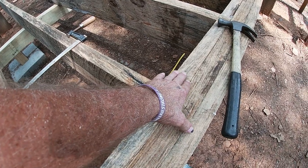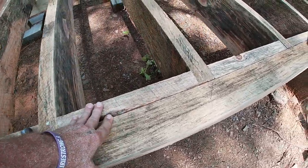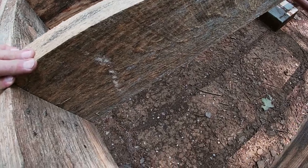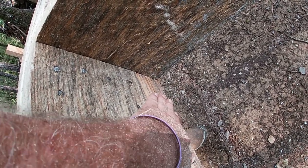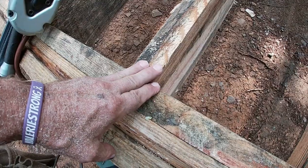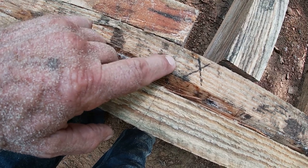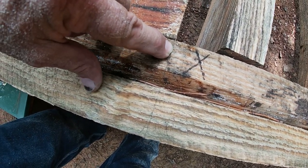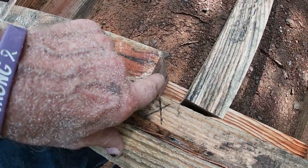I've started anchoring in the floor joists into the beam and I'm also putting a row of blocks in between the joists down through here. I'm using my framing gun to shoot these blocks in and nail everything together, but I am using some three and a half inch torque screws into the ledger. The block itself I'm nailing in with power nails — that speeds up the process a little bit. After I get one joist in there, I butt my tape against that joist and come over to my layout mark. These joists are different thicknesses, so I'm going to this side of the joist right here, that's the length, and I'm cutting my block and setting it in there up against the joist that's already nailed down, then I can bring the next joist over against that.